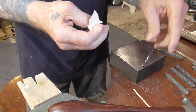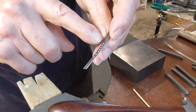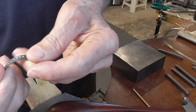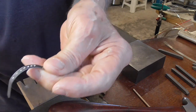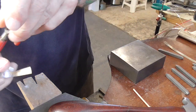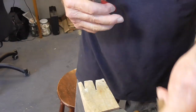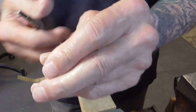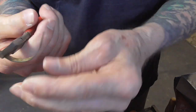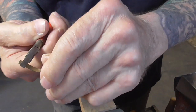Now, we annealed it, and because we just stamped it in the middle, we should be able to still bend it, because it's still annealed in between the letters. So we'll just use our flat half-round pliers, form it into an oval. Half-round goes on the inside. Don't grab the very end or you'll damage the metal.